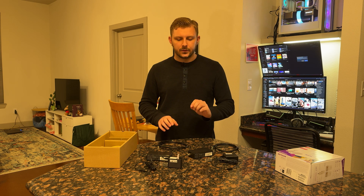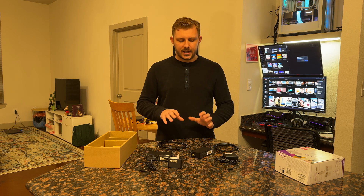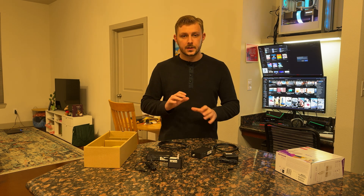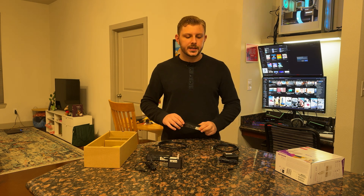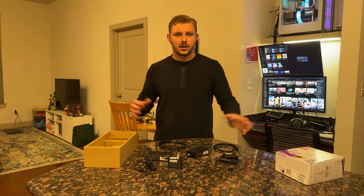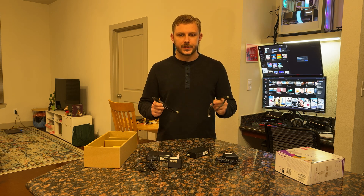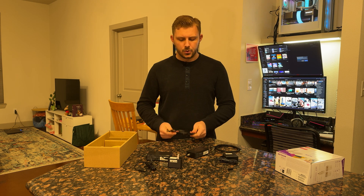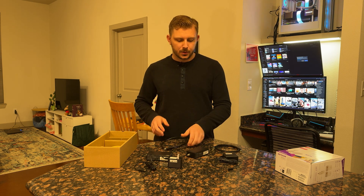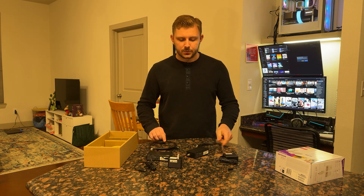The one caveat is that if you have satellite TV, there's a chance this could interfere, so you may have to do a little due diligence separating lines and running them individually. You can't just put everything on the same runs of coax like you could with cable internet. So there's a little nuance there, but for the most part it's a super simple setup as well.